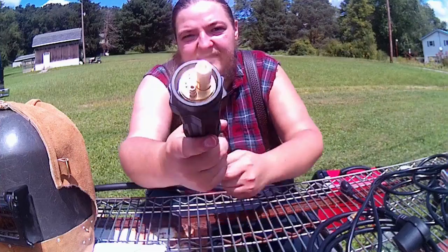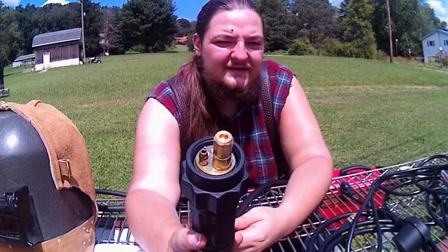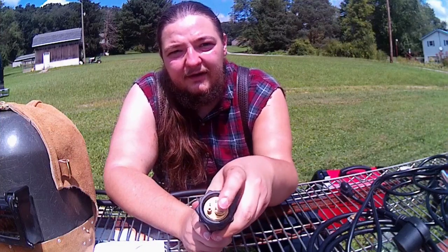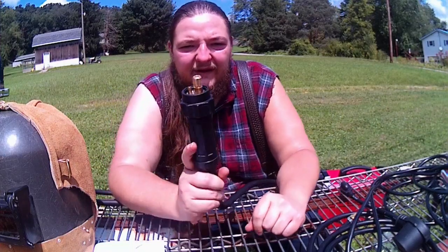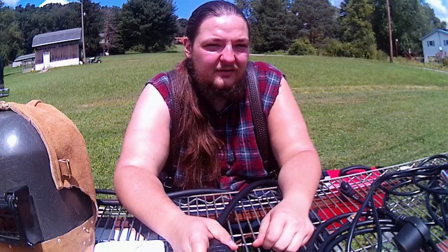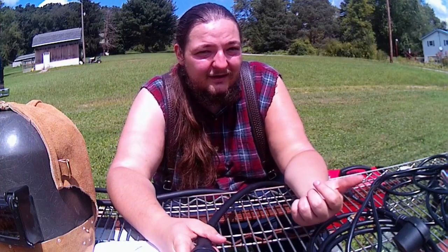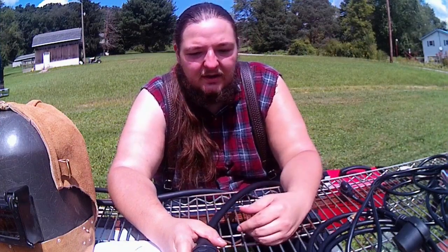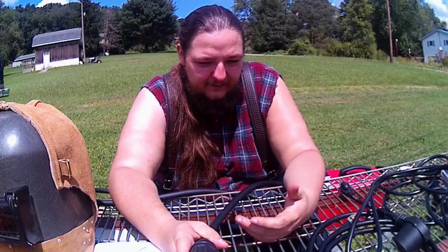But anyway, this is the Euro style connector here on the end. What that is, all of your trigger setups are here, your gas comes through here, and then this is your liner that the wire travels through. Everything is all in one piece on these versus the standard Tweco style hookups, which you have to put in the main lug and then set it with a set screw and then put in the second trigger wire, hook it up somewhere either inside or on the outside of the machine, and then your gas is built into the hose line, so you don't have to worry about that part.